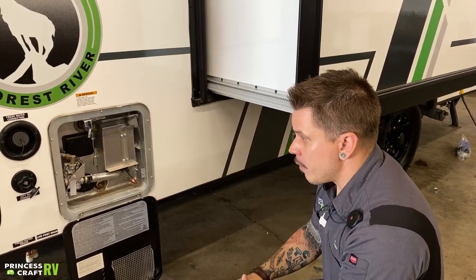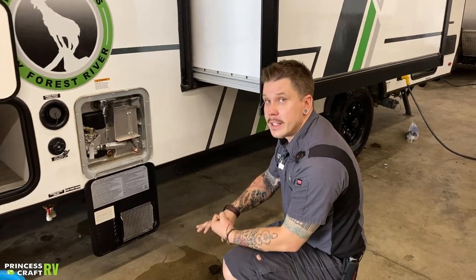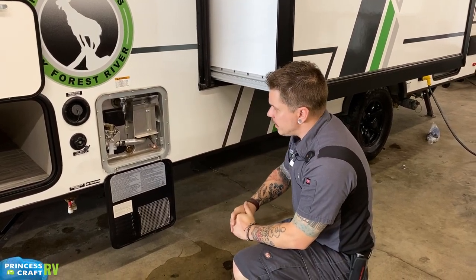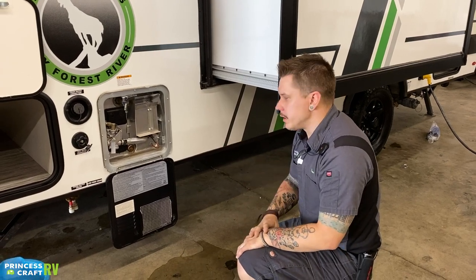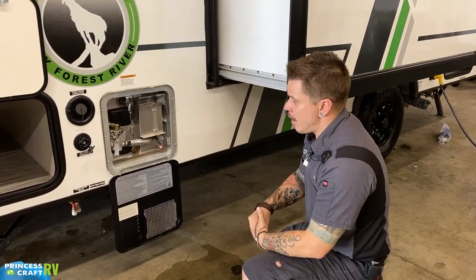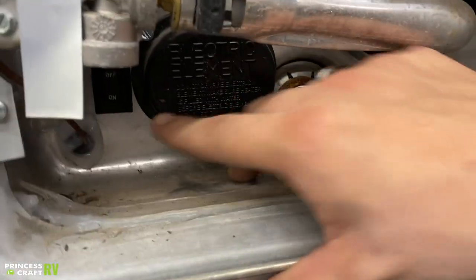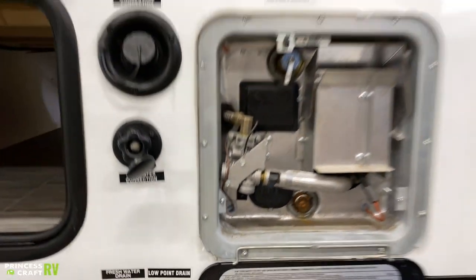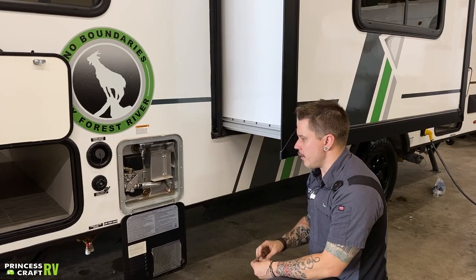It is possible to run the unit on both sources — that is going to give you the highest recharge rate. Both sources together are going to be 17 gallons per hour. Standalone propane is going to be 15 gallons per hour. The electric element is going to be somewhere around 11 gallons per hour. The biggest recommendation I can make when using that 110-volt element is make sure that you turn it off when you're done using it. People can forget to turn that off when done and then ultimately drain it — what you're creating there is going to be a dry fire scenario, which is heating the unit up without any water in it. That's not great for the appliance — you can actually break it by doing so, so we want to avoid that at all costs.